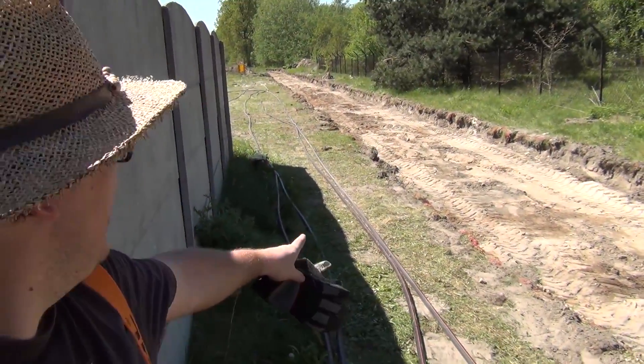We have rolled out cables. There are 4 cables — 3 of them are for telecom and one of them is for the gate, the signal cable for the gate. They're going to go in a trench or a hole under the road at a depth of 90 cm, and then on top of them there's going to be an electrical cable for the gate power.